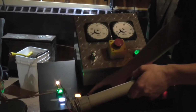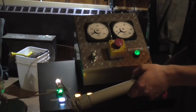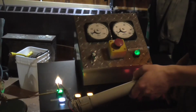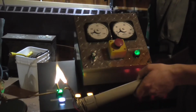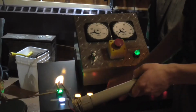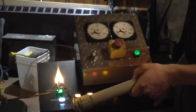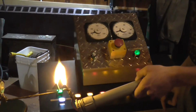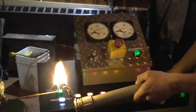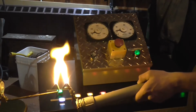We're going to add that extra 30 watts. That's not going to do much, obviously. That's close to 300 watts. But that 30 watts will allow us to activate the 700 watt portion of the ballast. So there we got an extra 700 watts. That's about a kilowatt worth of energy. I'm going to take off that 700. Give it 400. So there's about 700 watts there. Extra 300 watts. There's about a kilowatt. And there's an extra 1100 watts. It's about 2.5 kilowatts. An extra 700 watts. There we have our 3000 watts.